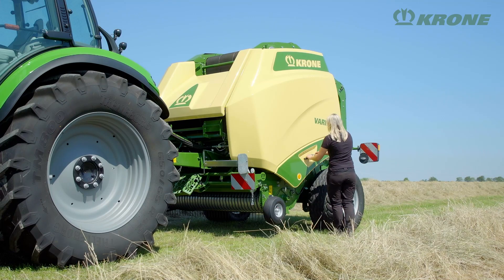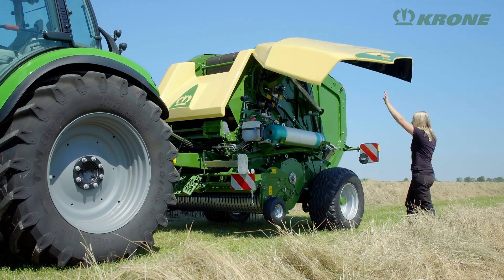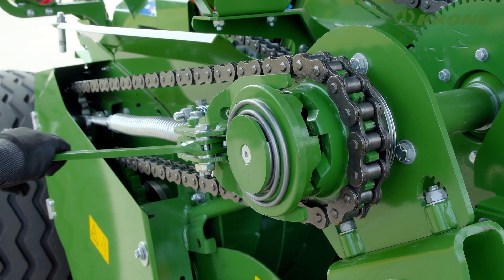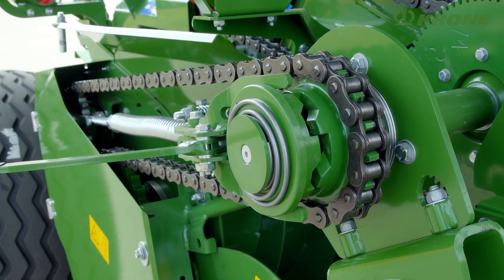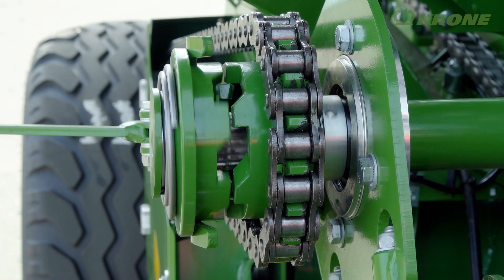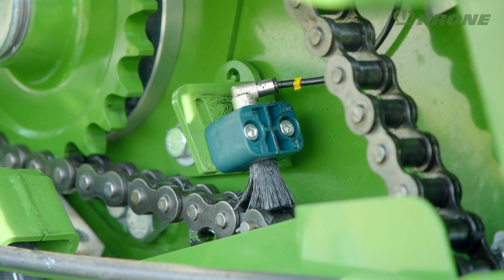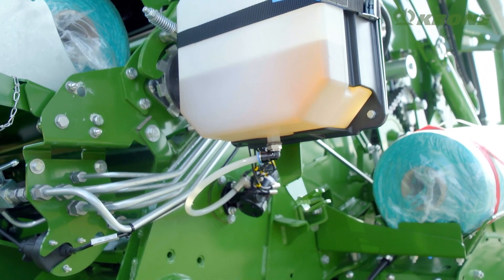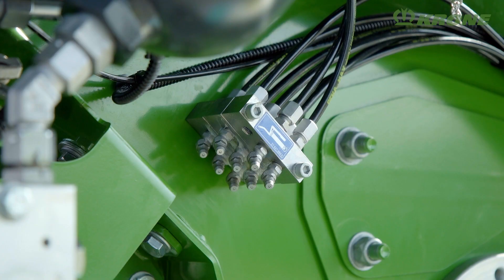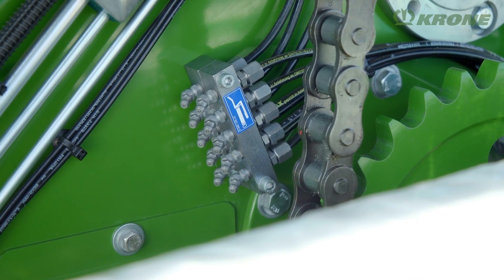The chains and drives are protected by large panels that prevent build-up of dust and crop debris. Machines with a cutting system are protected by a mechanical dog clutch that cuts the driveline between the intake system and the bale chamber. The chains are auto-tensioned and auto-lubricated, and the grease points are grouped on two banks for easy service and extended machine life.